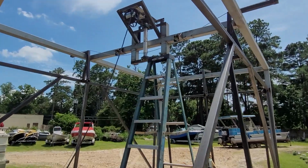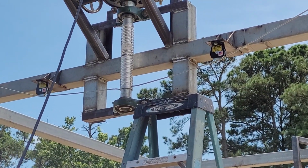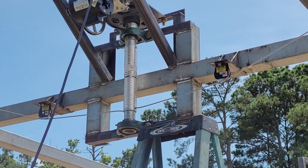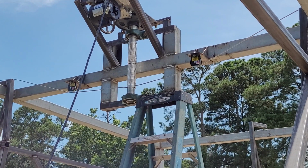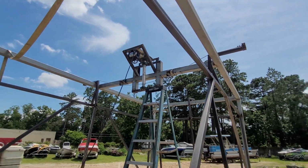Everybody said use hydraulics, and I thought about that. I just didn't want to. So we got this spool, and that spool is usually not vertical mounted. It's usually horizontal for a boathouse lift that moves 4 cables. And I got 4 doors, so I thought 4 cables would be good. So I had to do it vertical, so I had to add a couple of pulleys up there to get it to spool right, and they're just kind of tacked on there now.